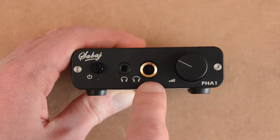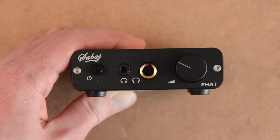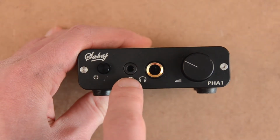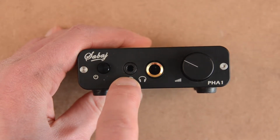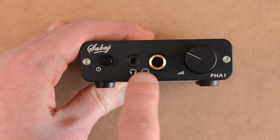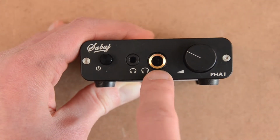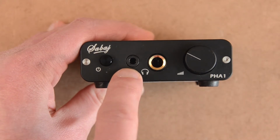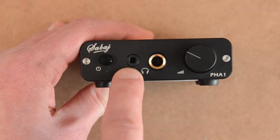If you saw my previous video, the amplifier is quite strong with low impedance. So I guess they did something very inexpensive to reduce the amplitude of the sound coming through the smaller jack, but it also makes the sound garbage. So if you want to use it, I recommend you really use only the 1/4-inch jack, not the 3.5mm. And I'm really curious to see how they implemented the lowering of the power. I think it's just a cheap way, like a series resistance or something.